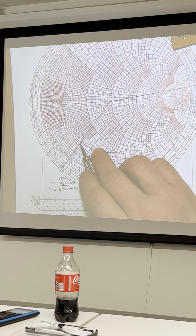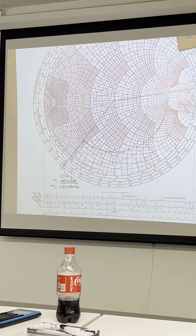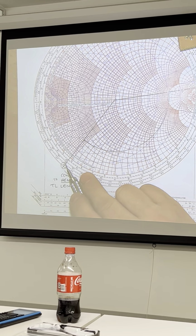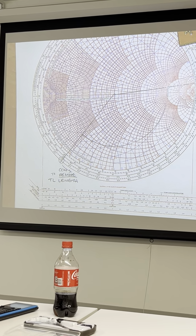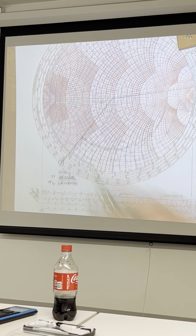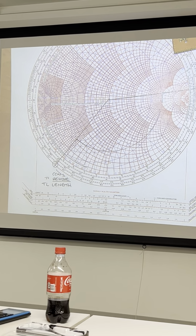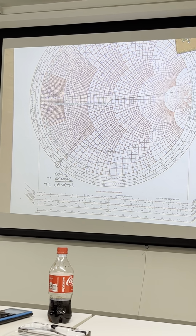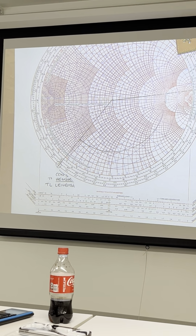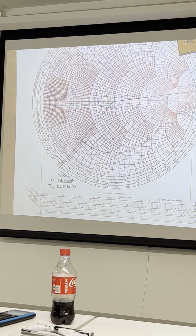Oh, okay. Right? And so you just draw a line through it, and that's just a starting point, just an index. We started at this point. That's not necessarily a measure of how many wavelengths you are anywhere. It's just where you started. And we want to remove 15 millimeters of transmission line length. So we calculated how many wavelengths 15 millimeters is on this board. We had to take all this geometry into equations, for this Saturn PCB, get an effective epsilon so we could calculate a wavelength.